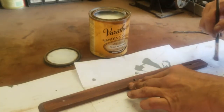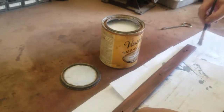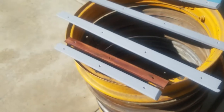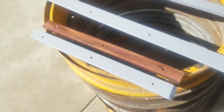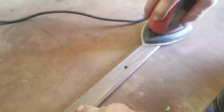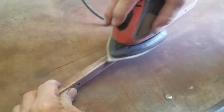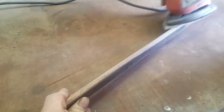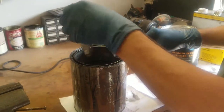I go through one round of sanding sealer and we'll show you how we sand it. We actually do a second round with the same process. Here it is out in the sun at 84 degrees having had the sanding sealer on it. Now I'm back with the mouse sander using 240 grit sandpaper going back over it. Once we complete this, I repeat the sanding sealer and the 240 a second time — we didn't show that, it must be a little boring to see it twice.